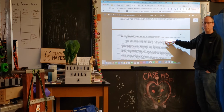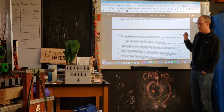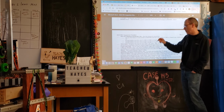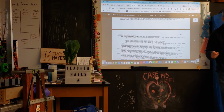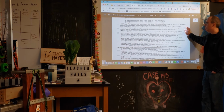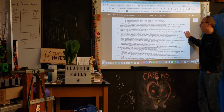We spent a lot of time on these ones, if you remember. They were very specific on wire size as well as the size of the fuses in different cases. For instance, I think we had to swap out for a different breaker. I think we had a 15, it was supposed to be a 20. I don't remember which way it was, but he had a fuse for us that we had to swap out. Wire color, always good at that. That's pretty easy. You could use something other than copper, but that's what we use. One per terminal. He was definitely checking this to make sure we weren't sharing several items. There is a specified list of motors, but we always stick with those as well. Similar for solenoids, and then actuators.